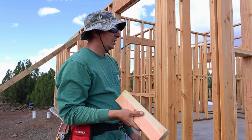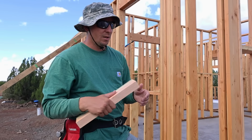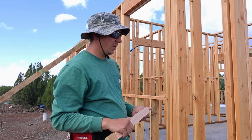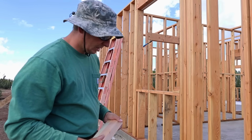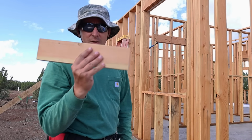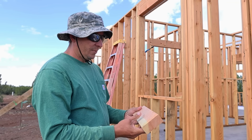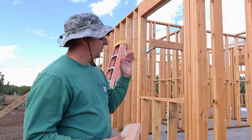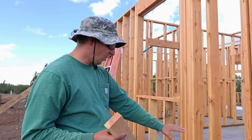And the blocking is for our own style of siding. We have our sawmill and we're going to be sawmilling live edge siding for our home. It's going to look pretty much the same as our shed, but a little better, I think, because now we know what to expect. We know what to do, like putting blocking in. I did not put any blocking in when we did our siding over there. And we need it to help hold down our custom siding. So that's why every 16 inches, it'll be screwed down. And below that, it'll be the rock facade.